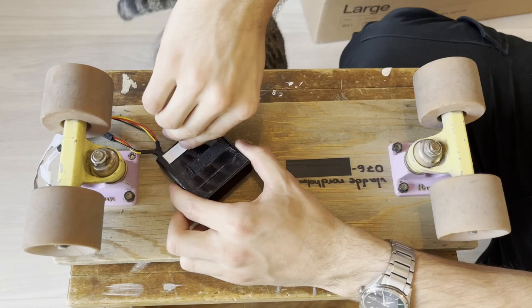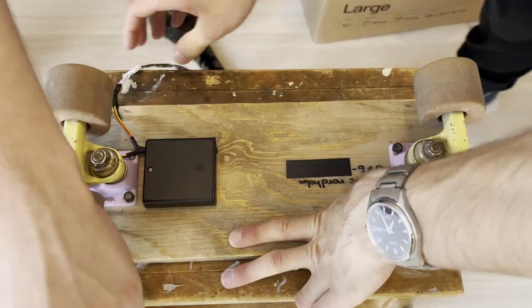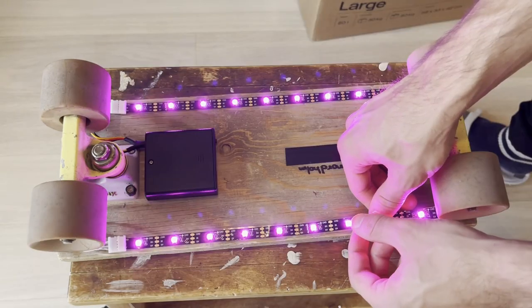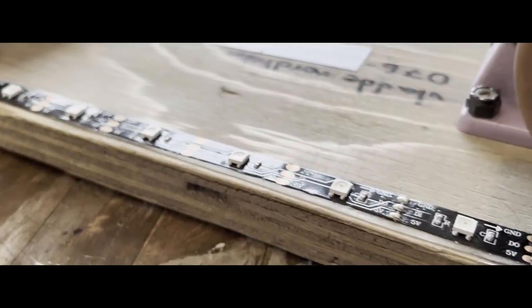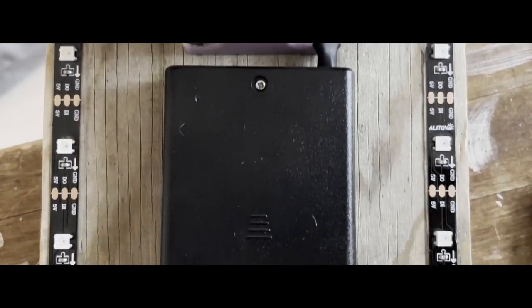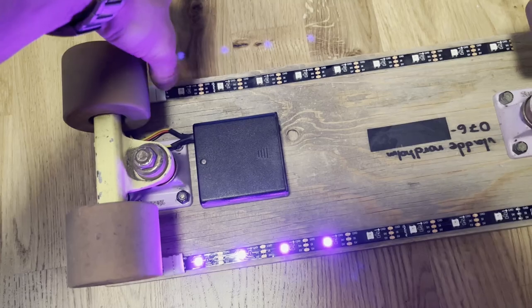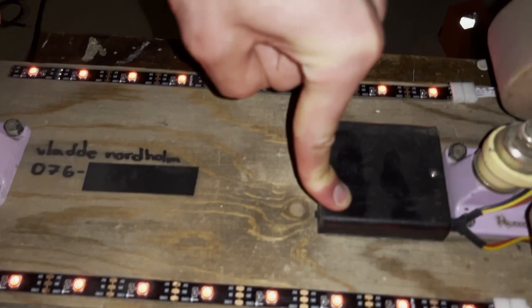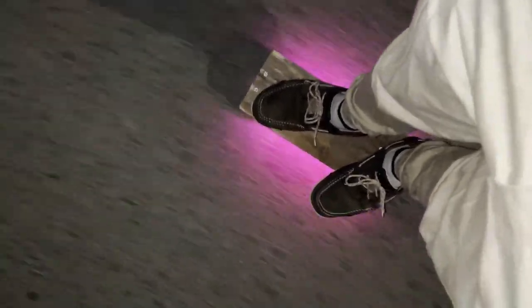It seems like we have another guest in the video. So here's how it turned out. Quick notes — we had some issues. Some connectors were loose in one of the LED strips, so we soldered it stuck. Because of the vibrations when riding, the batteries probably lost connection. We tensioned the springs in the case by putting in some aluminum foil — a real hack, yeah. It did look cool when riding though, causing this flaming effect.